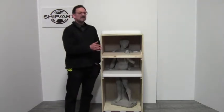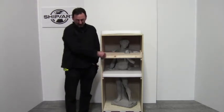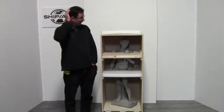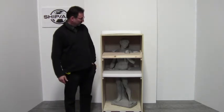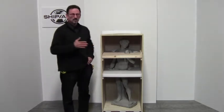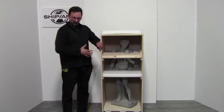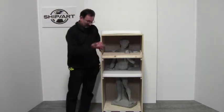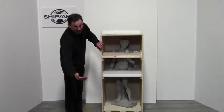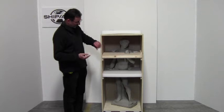Obviously when you're using this kind of beam brace, the box beam style, it's going to be something pretty massive. It could be a giant stone. That's where I've used them. There in particular, you want to be able to strengthen the box as much as possible, because you can only do so much without putting railroad ties up the side of your crate or whatever. And by isolating these planes in here, you're strengthening the whole thing a massive amount.